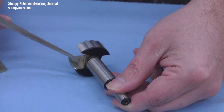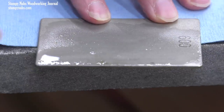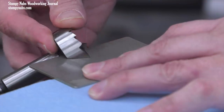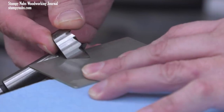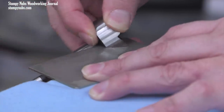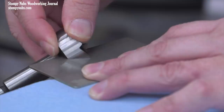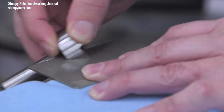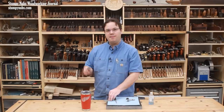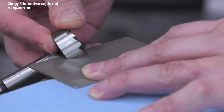Let's start with the chippers first — this involves these two flat surfaces. I like to use some lapping fluid to keep the metal dust from clogging up the grit on my hone. Then I place the card on the corner of my bench so I can lay the flat chipper surface on the card. I can feel when I have it flat and I want to keep it that way as I move it back and forth five times. Just back and forth strokes five times, using only enough pressure to keep it flat on the card. Putting the card on the bench and holding the bit on top helps me keep it stable as I work.